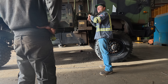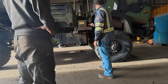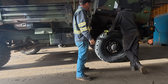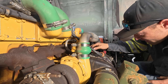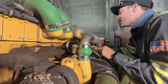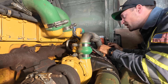I think our problem's the alternator for sure. It's that weird 14-volt and 28-volt military configuration. One of these wires is going to make it go full party mode — that should be our Excite wire. This wire right here is the Excite wire — it's wire number 97L. This is the 24-volt side. We're seeing 26 volts, overcharging our batteries. Technically, if we take this wire off it should kick it off. I don't see any super heavy corrosion, though there's a little corrosion on this wire. There could be some corrosion inside causing a bad ground. It's also pretty warm — with no load on it at all, it's pretty warm.